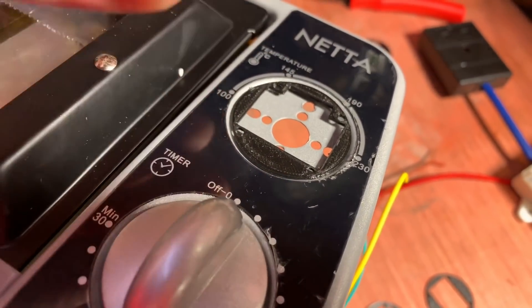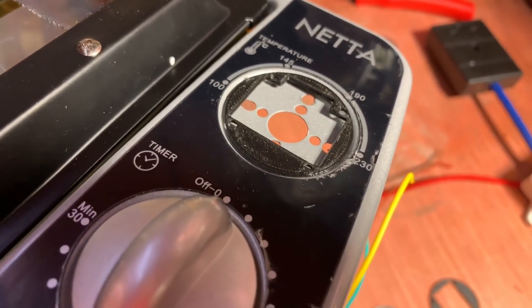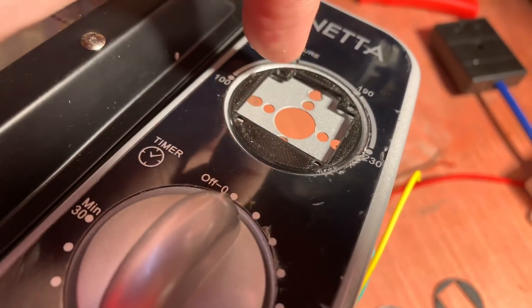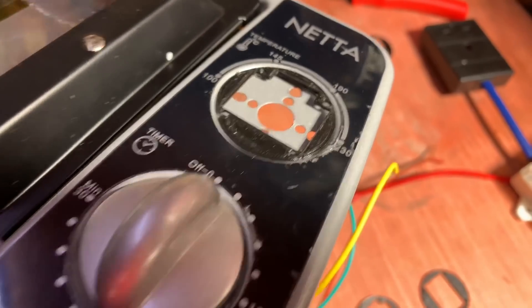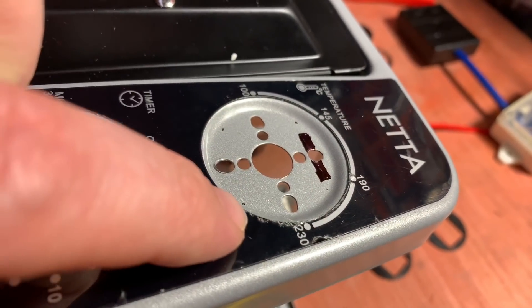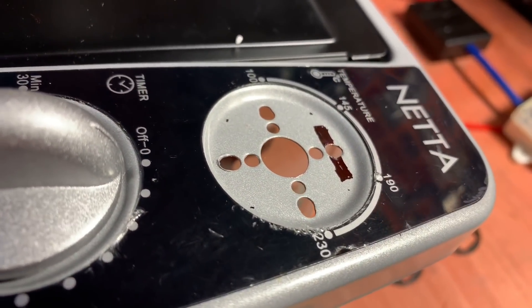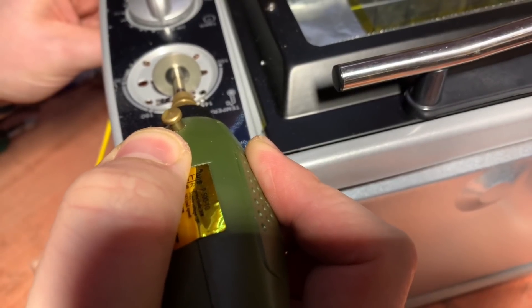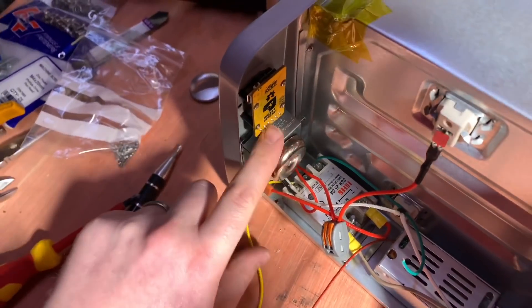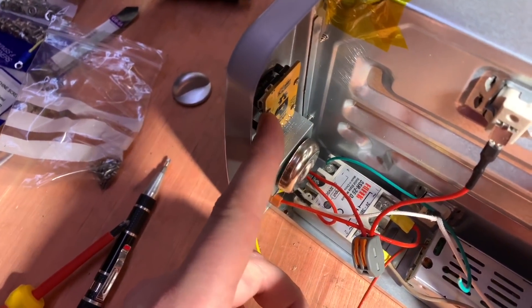This little 3D printed spacer gives me the holes I need to drill - all four of those - and also the space here at the top in this cutout where I'll need to cut out the actual case of the oven to get the I2C screen connectors through: VCC, ground, SDA and SCL. I'll just get a marker and mark this up. Two millimetre holes are required, but I'll put some slightly bigger ones in there, and this section up here needs to be gouged out - I suspect I'll use my Dremel type tool. So there's my OLED in the front of the oven, connecting to the Tiny Reflow Controller behind that panel.